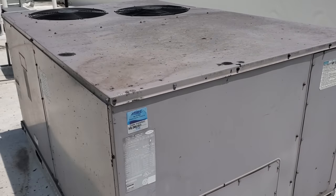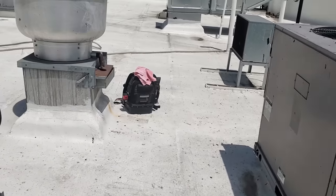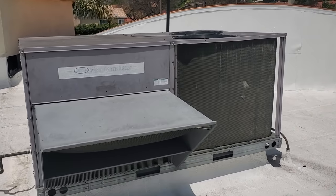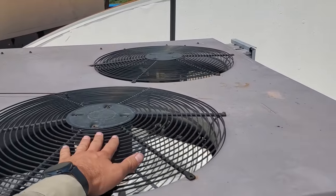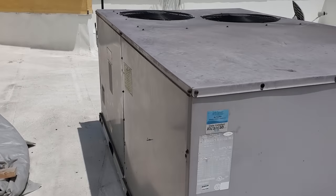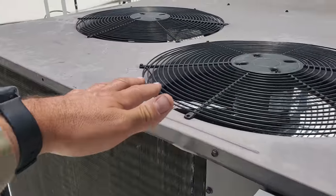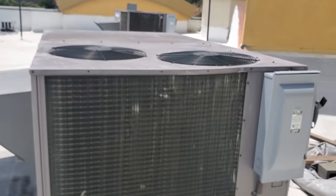They're saying the kitchen AC is not working — that was the reason I came. But when I walked in, they said it doesn't feel like their other ACs are working too properly. So I went ahead and ramped everything on. Every unit is calling, but there's cool air coming out of the condenser right now, it's not hot. I don't think any compressors are running in this one. This other unit is moving heat — I've got a lot of heat coming out of the condenser on this one, so this unit may be working okay, but it's making a weird noise from a motor or something.